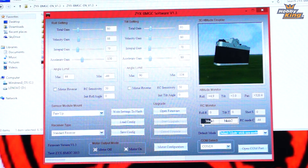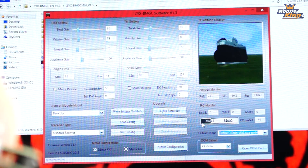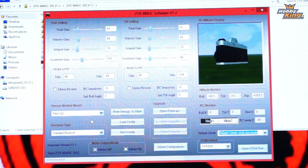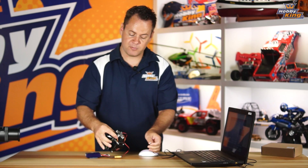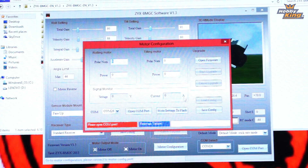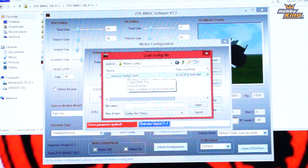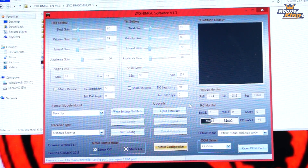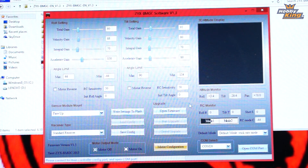That's pretty much all you need to know on this GUI. Make sure the camera is mimicking what you're supposed to be doing — that's controlled by the file we loaded, which changes the sensor position known as the IMU. Now for motor configuration: unplug the USB from the bottom port and plug it into the top port. Click on Motor Configuration, open the COM port, load the configuration from the same file, click open, then write settings to flash. That sets up the power poles and everything for these particular motors.